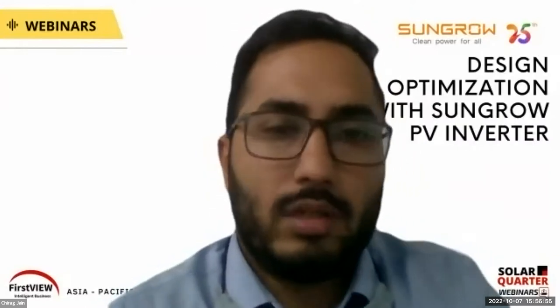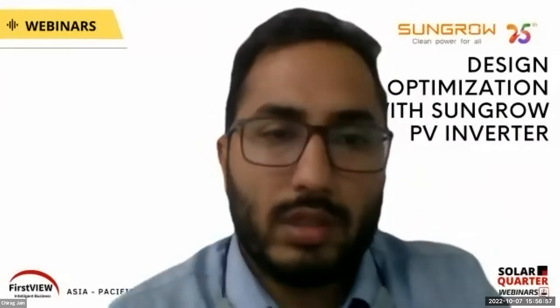Mr. Rohit wants to know if there is a configuration for a PV plus diesel generator hybrid solution. Our inverter will generate the AC power, but the synchronization part we can't confirm, because it is a third party integration they have to do. They have to provide remote protection relays and similar applications for the synchronization purpose. We don't have any recommendation on the synchronization; we only answer questions related to the inverter.